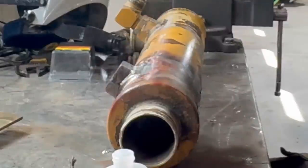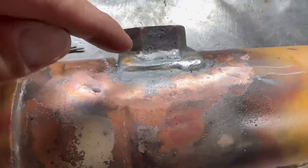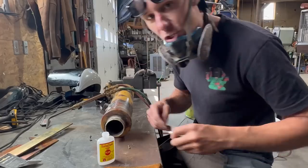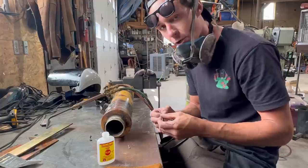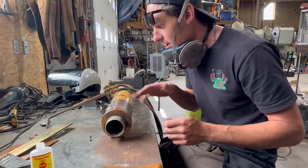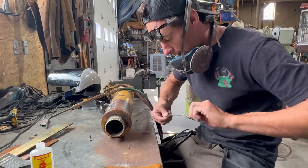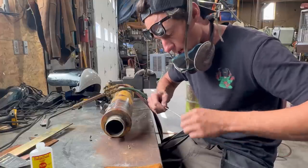Exactly what I did not want to happen just happened — the bead fell out. I think I'm starting to get it though. As you can see I've got a pretty good mass over that area and I'm hoping it got sucked into that little pinhole. There's no way for me to really know, but I'm getting a real nice solder right there. I just need to continue that all the way down and I think we've got this. What I've discovered is that I need to get a thicker piece of solder in there — there just wasn't enough filler material. Also, dumping a little bit of flux on while it's hot seems to make it thicken up and actually give me that flux coating I'm looking for. So I'm going to twist the solder together like I would do with copper wire when TIG welding copper.